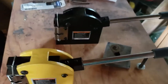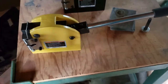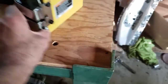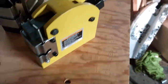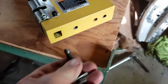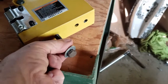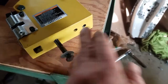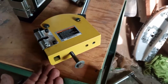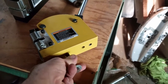On my bench — this is my portable work table — the reason I like it is it's three-quarter inches thick and a nice solid base. I drilled a hole in here and I'm using a bolt. There's a screw hole underneath, and because you're putting most of the pressure in the front, you really don't need a base in the back with this kind of setup. I screw it in from underneath, it secures it nice and tight, and then you can use it.